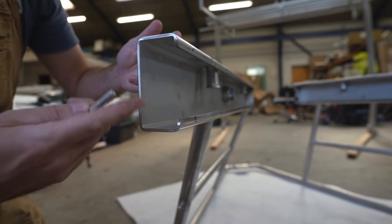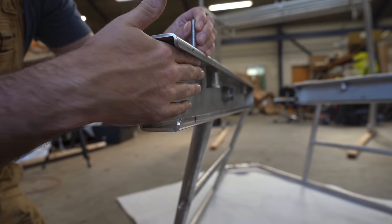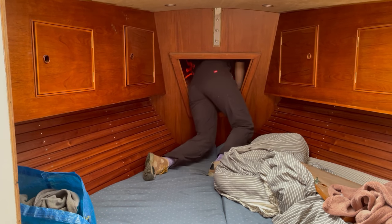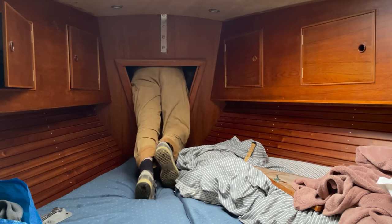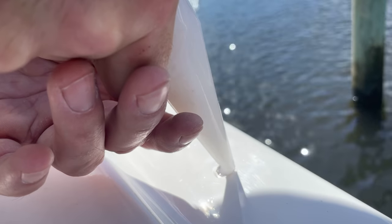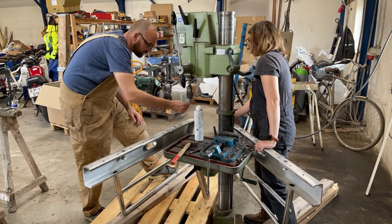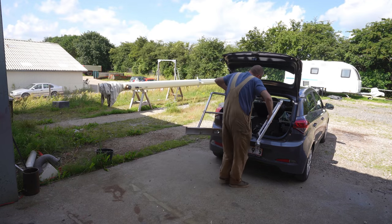Right now the pulpit is upside down so this may be a little confusing, but the bolts go in here. There's a bag that slides in here and there simply was not enough room between the head of the bolt and this flange to fit the bag. Unfortunately to fix this issue we had to remove the fully installed pulpit — Ava and I took turns undoing the nuts in the delightfully cramped chain locker. We filled the holes in the deck-hull joint with thickened epoxy and brought the pulpit up to the workshop to drill new holes. That might sound quick, but so far we've spent about two days doing what should have been a two-hour job. I have high hopes that today is finally the day we'll be able to install the pulpit.